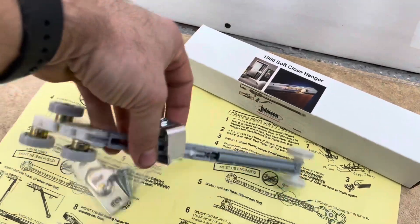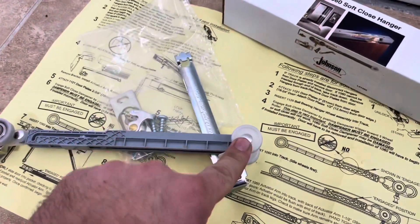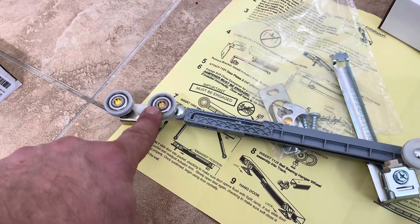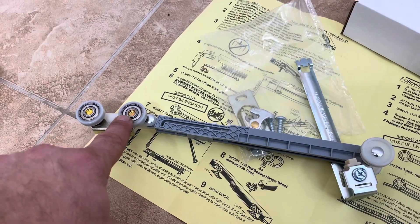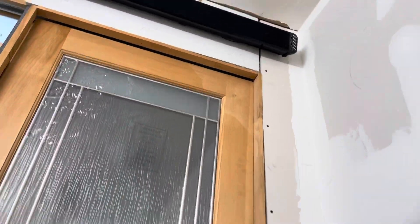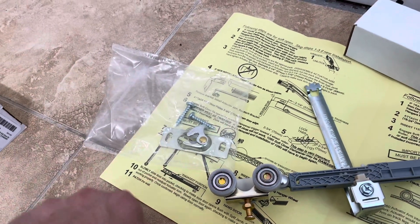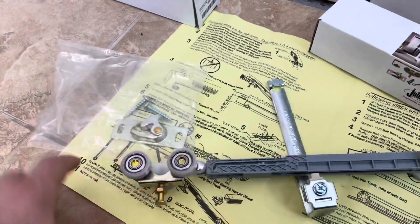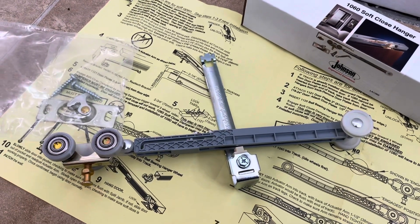Part of this whole mechanism goes onto your pocket door. Typically on your cheaper hardware you'll have the non-bearing version — you don't need the bearings. The heavier doors that are solid core and sound-deadening need the bearings. Anything bigger than 80 inches, I recommend bearings — actually I'd recommend them period, but if you just want cheap hardware it'll save you a few bucks. You'll get something like this, which is what you see at the top of that door — just cheap stuff. They're all pretty well designed the same. These on Amazon are $75 each, so you're looking at $150 in hardware right here. That's a lot — very expensive.